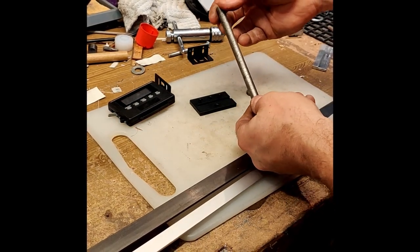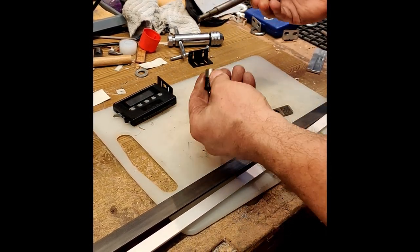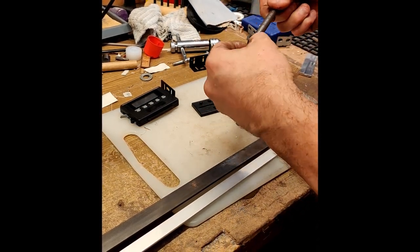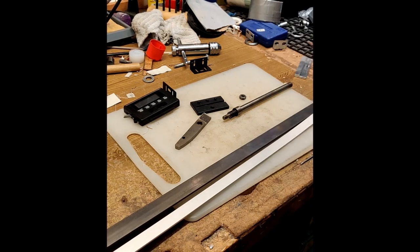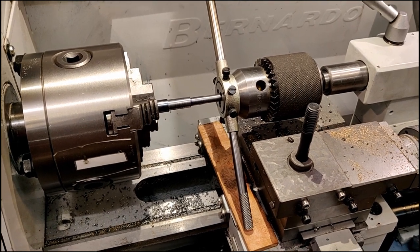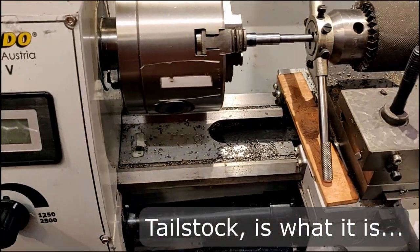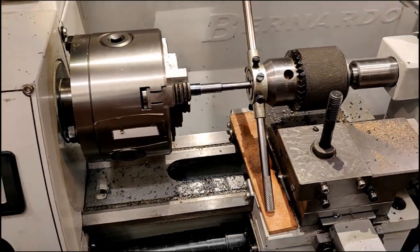This thing has a millimeter scale but you can hardly read it. It's three diameters and a thread, and it has a feather spring — spring loaded — whatever you call it. This is a very good way to cut threads — better than doing it freehand. Just follow with the guide here and as you start turning, you'll get straight threads.